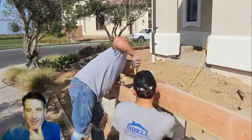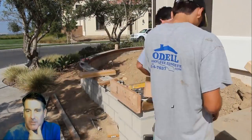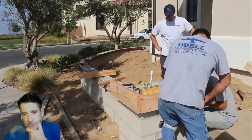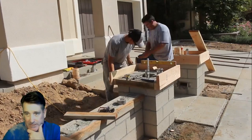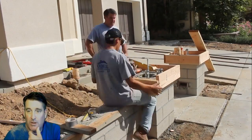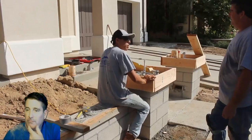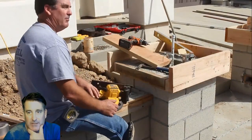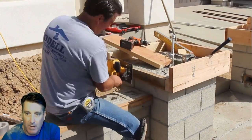It all starts with the block — any build always starts from the ground. If you're not plumb and level when you start on these blocks, when you get to the top and start building these forms you're going to run into a lot of trouble. Fortunately the block was level and plumb and exactly where it had to be, so all I had to do was follow the block.